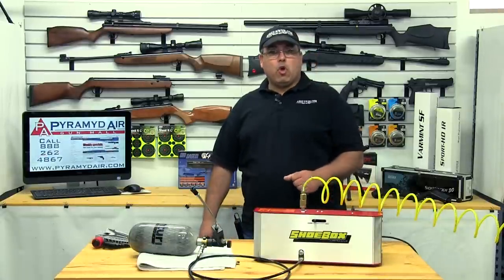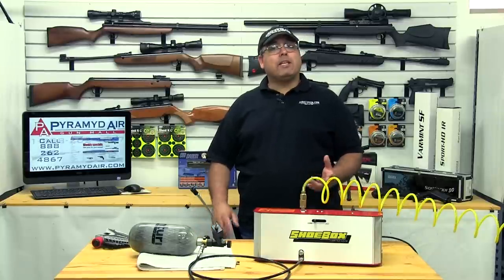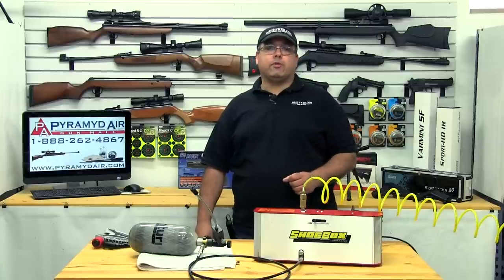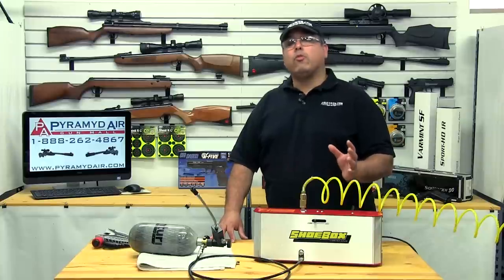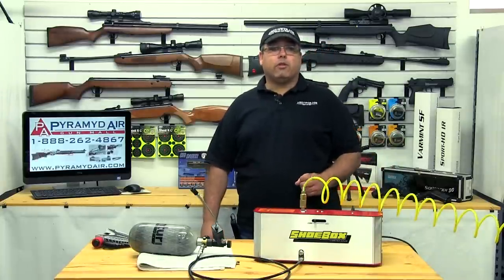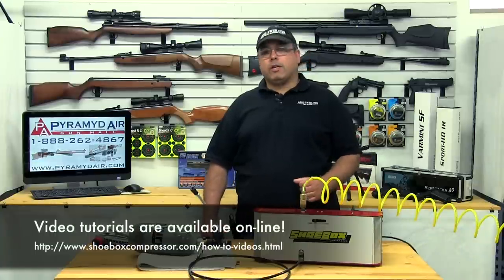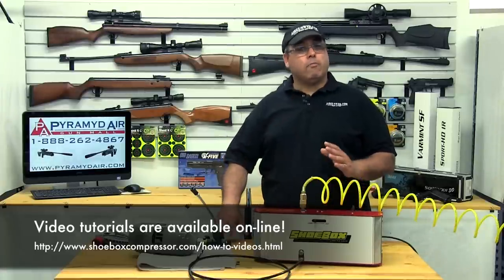The Freedom 8 requires regular and diligent maintenance. Here are some basic guidelines, which are fully outlined in the manual. You're going to need to dab a drop of white lithium grease on the pistons every 2 to 3 hours of use — only use pure white lithium grease; don't use any substitutes or you risk damaging your compressor. You'll also need to rebuild your compression cylinders at about 70 to 100 hours of use. Rebuild kits are easily available and there are videos that will walk you through the whole process. Do your research on maintenance procedures and make sure you're up to the task before you make your purchase.